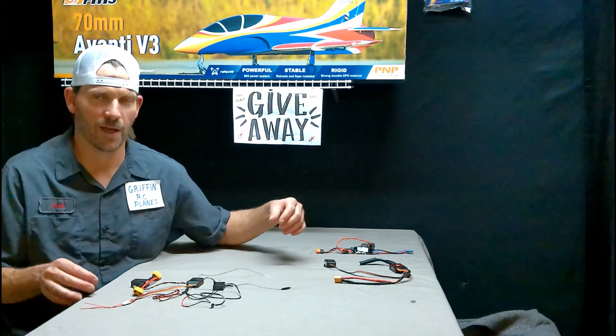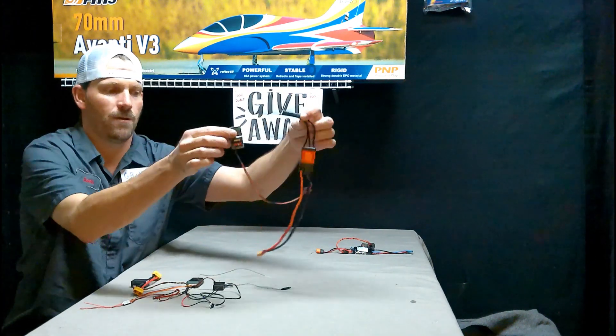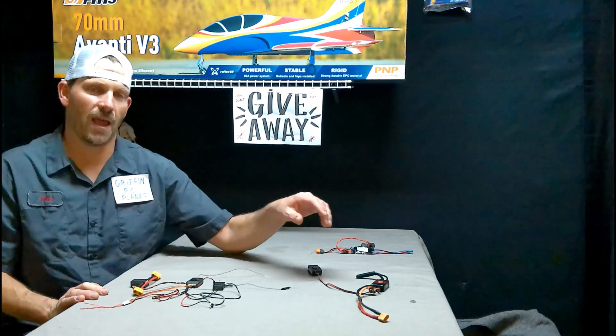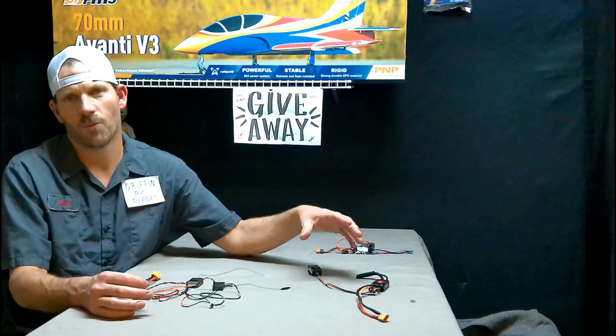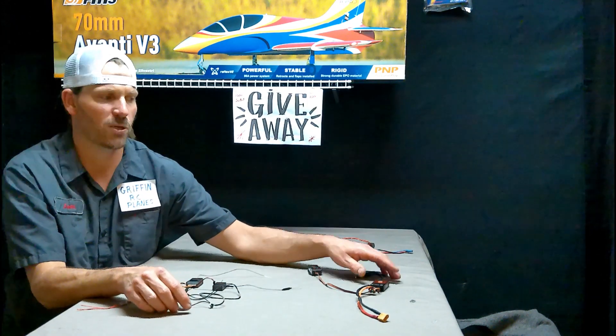In the new age of things, we have smart receivers. This setup right here does everything the TM-1000 does. And if you're using a Spektrum smart battery, you've opened up the door to seeing all the battery data — each cell voltage, battery temperature, how many charge cycles you've had. Everything that's smart and available in the battery you can now see, because the smart battery is plugged into the smart speed control going to the smart receiver.